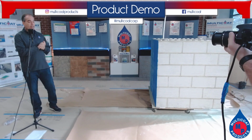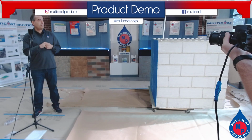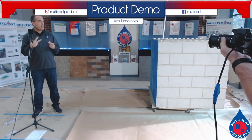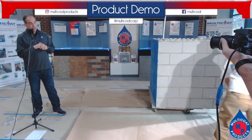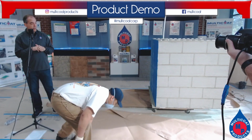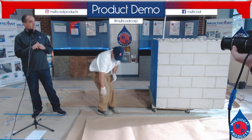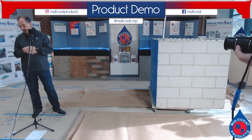When you have a premium job, you have a custom home, you want the best of the best, we recommend this latex system for below grade. Multicoat has to be rolled for below grade applications. And Alfonso's getting this ready here, it's basically rolled in 2 coats. Throw sand on the second coat and then scratch coat. No sand for Slatex, that's true.